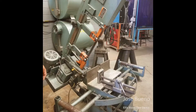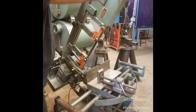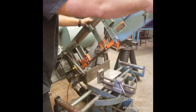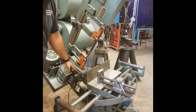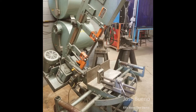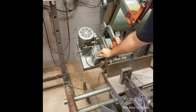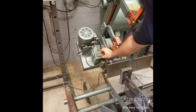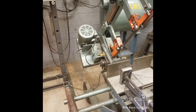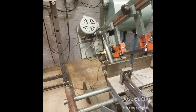Let's go ahead and take a look at the hydraulic system. In essence, the hydraulic system serves two purposes. You can use it to control the feed rate, which is basically how much weight is being applied to the blade as you cut through the material — not so much the speed of the blade. It also serves as a secondary safety feature: if someone were lowering the bandsaw and lost their grip, it prevents the bandsaw from slamming down on the material and damaging the blade or equipment.